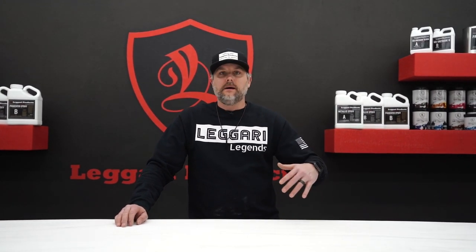Okay, so now we have everything repaired, all the craters, the defects in the faces. So that's how you guys can repair any issues that you have on your project. So now we're gonna clean it really good, denatured alcohol, a lint-free rag, hopefully. Never wanna get a bunch of lint on it right before we do a top coat. And then we're gonna apply our matte urethane on this.